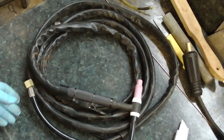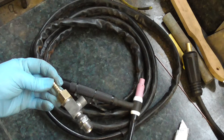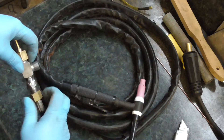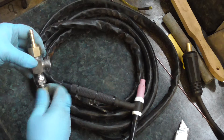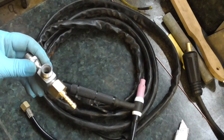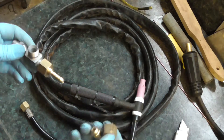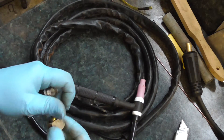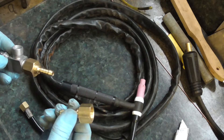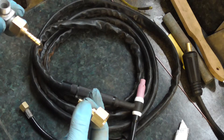So I've been working on it already and what I've come up with is this. This fitting here fits this — it's a metric fitting — so that will go off to my lead. This will go onto a rubber bit of hose which then has another end on it like so: 3/8 BSP, which fits onto the Power Weld. Therefore the bit of rubber insulates the power feed.